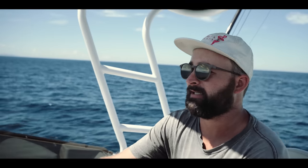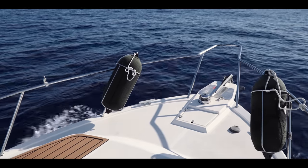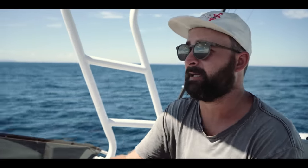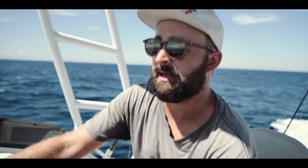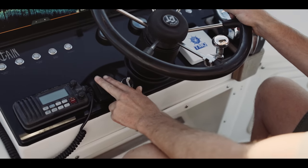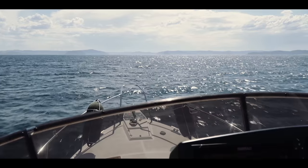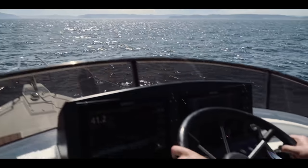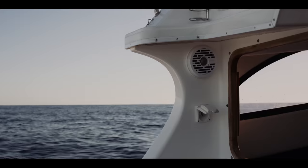She does take a little bit of work to get up onto the plane. The bow is quite high at the moment — I'm almost at full throttle pushing this thing. 15 knots, now 17 knots. We're coming onto the plane now. I'm going to have to start working the trim tabs because we're very off-kilter in this nor-easterly wind. I'll trim up the stern drive, get a little more lift. Still working the tabs though — I've got no idea where they are. There we go, now we're at a good cruising speed: 21 knots, smooth sailing all the way home.